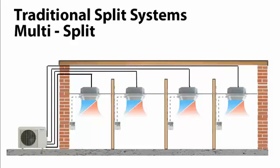The next advance from that was the multi-split unit, as you can see here on the screen. This did allow multiple zones to be fed from one condenser unit, although a lot of pipe work has to be installed so each zone is individually piped. These systems are quite a lot more effort to install, are usually way oversized, and do not provide very good or very close control.